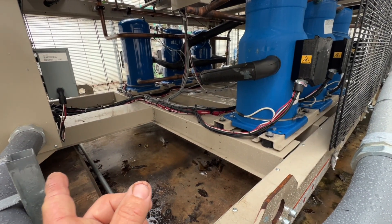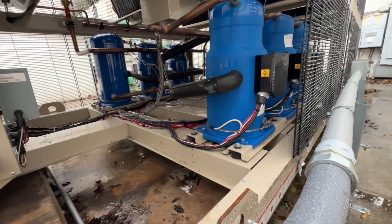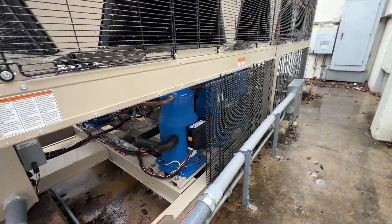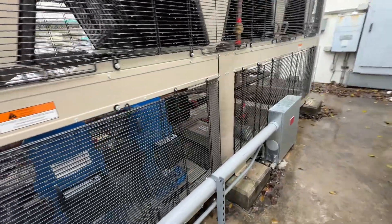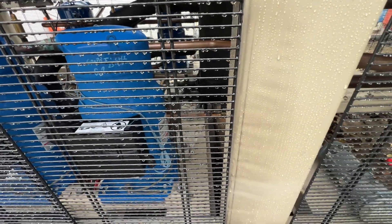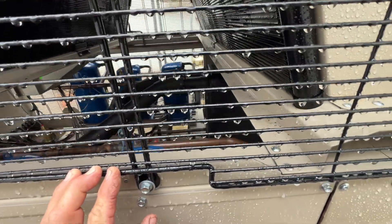One thing I don't really care for — all those exposed wires. I mean, the rats are going to love it; they've got more to chew on now. So overall looks like a pretty simple chiller. Why was it making that snoring noise? I don't know. First time hearing that. You could see how it was flashing through the electronic expansion valve in the beginning, so the flashing was corresponding with the noise.